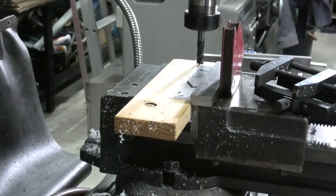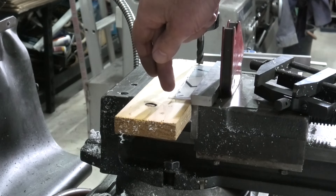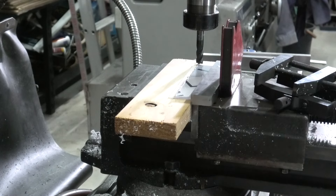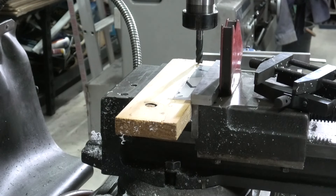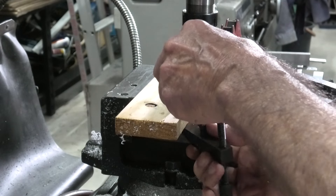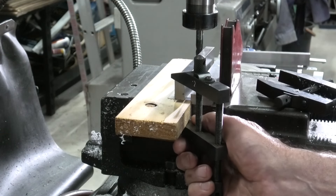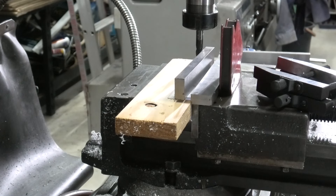I'm really a bit surprised - I did succeed. It's a very Heath Robinson outfit and I have to do a little bit of adjusting because I go from 0.98 to 0.82mm in thickness, so I'll put a dial gauge on it and adjust this bit of wood so it's a little bit flatter. I've got a homemade parallel as a backing strip held in place by a welding magnet, which keeps it out from the fence. Next comes another homemade parallel and two clamps to hold the parallel in place. That worked quite well - I've got clearance enough for the chuck to go past and clearance enough for the cutter. Everything seemed to work well.